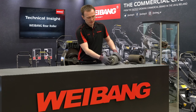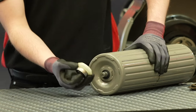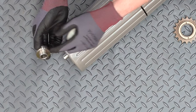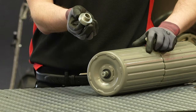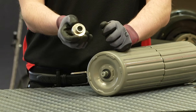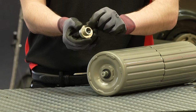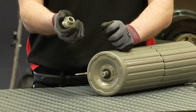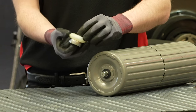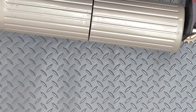Another bit of protection we've got on the machine is our bearings on the side — you can see here that they're actually stainless steel in design. We make our own bearing and we also put a little protection cover on, because we found that over time dirt, debris and mud was actually getting at the side of the bearing and pushing into it. This little stainless steel cover helps to prevent wear on the bearing and should allow you to get at least the season out of it before it goes back to your dealer for your annual service. We also have a little rubber cap on each side, so when the roller is sitting inside the rear roller frame it's nice and supported.